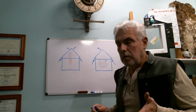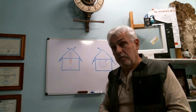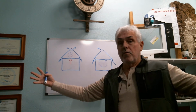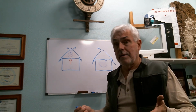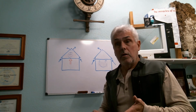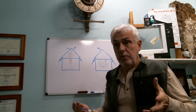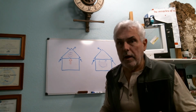So let's talk a little bit about this whole issue of moisture and humidity. It's a known fact that most of us are going to produce probably 15 to 16 pounds of water per day. That's moisture going through the structure from us, all right? There's a lot of things that can enter in as factors that can change that. Cultural, for example, there's a lot of cultures who use a lot of steam when they cook. That adds to the moisture load. Teenagers, oh dear God, I've had two. I understand about how much moisture they can put into the structure during their 45-minute to 1 hour showers.